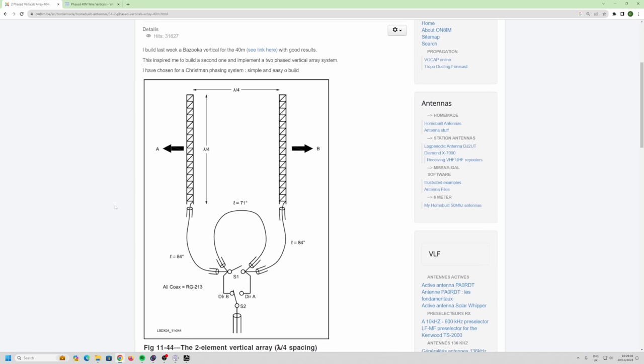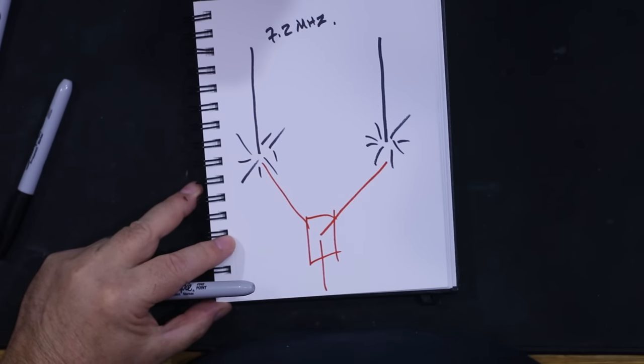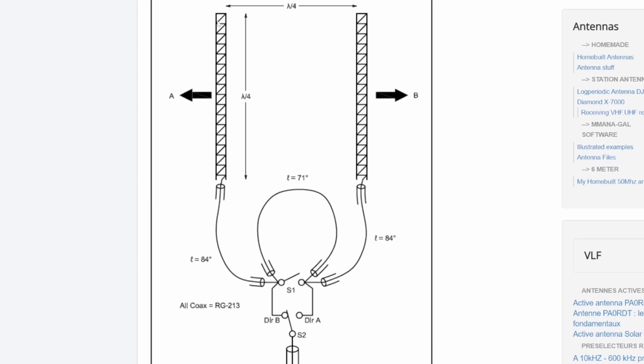Now, in a video I did not so long ago, we talked about velocity factor and angles. If this confuses you, go back to those two videos and I'll put the link in the description. So this is the phase verticals. You can see my picture here is similar to what you've got on the screen: the verticals have a quarter of a wavelength distance between them, and they're a quarter of a wavelength high, and they're tuned, so it might not be quite a quarter, to make it exactly on your frequency.